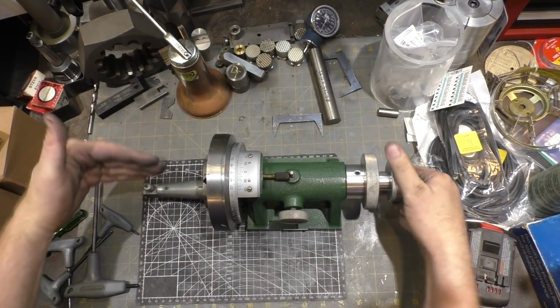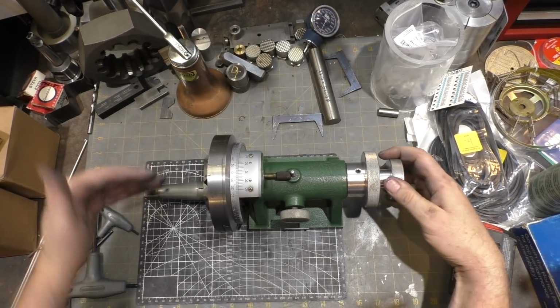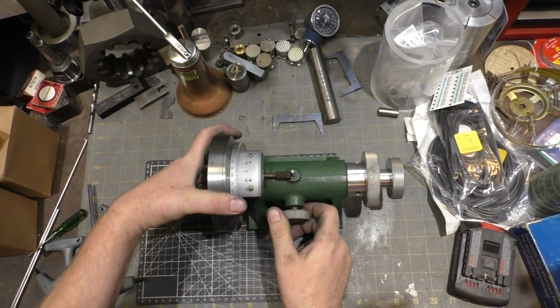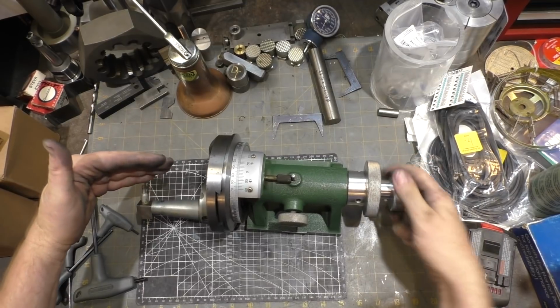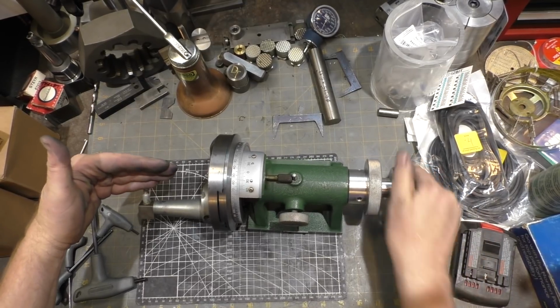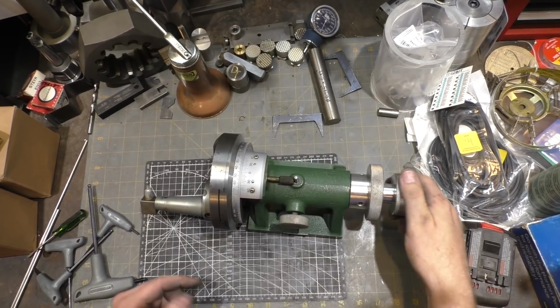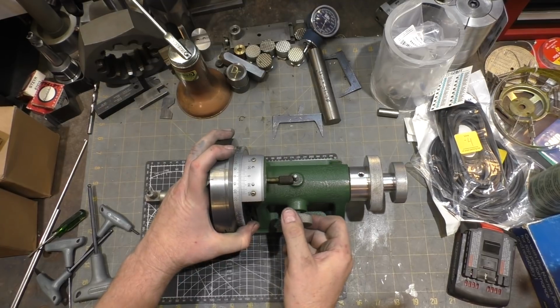So right now, if you picture your grinding wheel sitting here, this will cut a flat on the bottom of the grinding wheel with the vernier here on 0. If I loosen this guy and then lock it off again at say 45, now you can picture I am doing a chamfer cut on the edge of the wheel, and I will grind a chamfer on the side of the wheel that I can use to impart a chamfer on a cut.